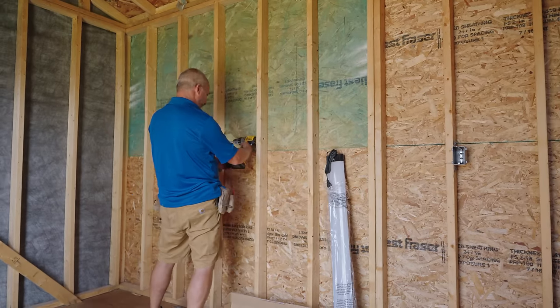Okay. A marrette is not on until the wires themselves are twisted. That's the proper technique. And if an electrical inspector comes in and opens up your box, and they see that wire twisted like that, that might be the last box they look at, because they're going to know you know what you're doing. Okay, here we go. Ready to sync this sucker.